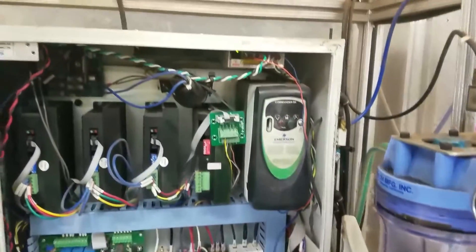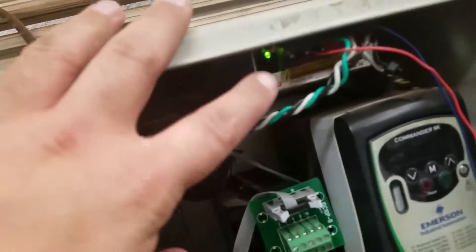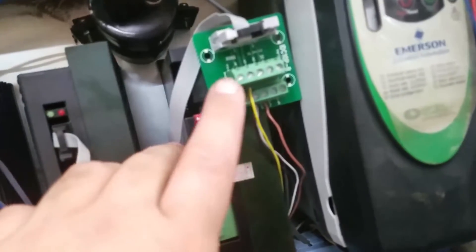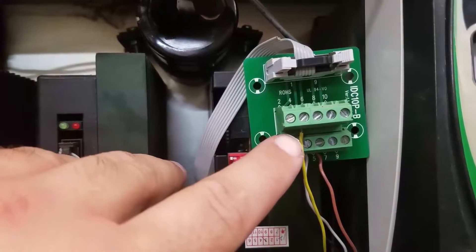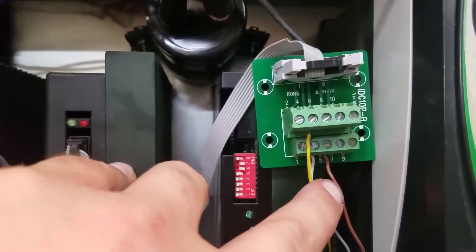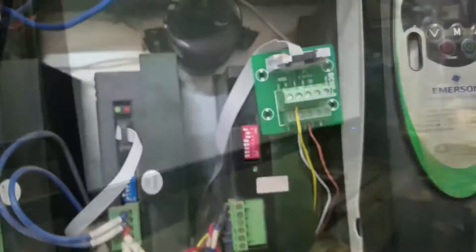That should take care of all your wires - it's really that simple. Your enable pin: orange and blue, get a 5-volt signal for those. Yellow: negative step. Brown: negative direction. Black and white: positive common. And that's all it is for wiring.